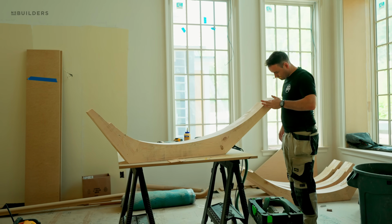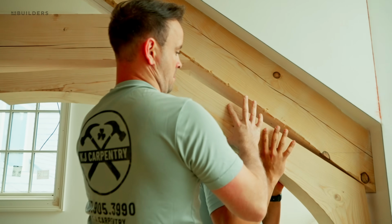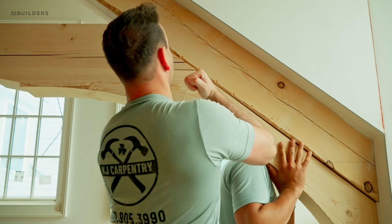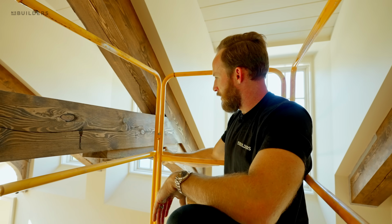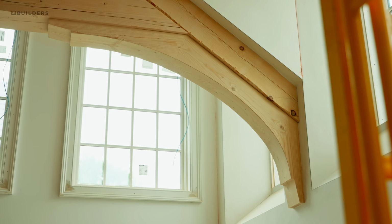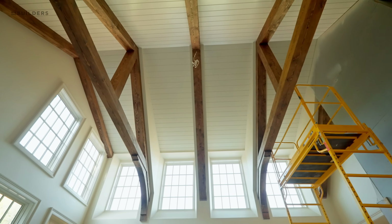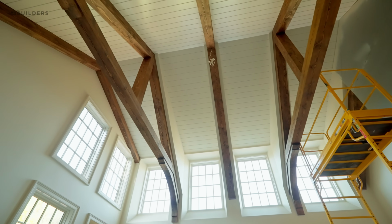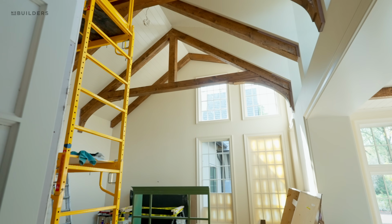And then everything is anchored through the face of it. Now, I mentioned earlier in this video that all of these beams are tight to the framing, and then we brought our plaster detail to it, or our tongue and groove detail behind it. In this case, for the bracket, we actually land on top of our plaster here. These are a decorative bracket. A couple things that these do: they cover all the screw holes that are in this cross member that attach it to the rafter. And lastly, they bring these down and soften the look of these trusses, beams, rafters, whatever you might want to call them, but essentially bring this cross member, curve it, and bring it down to the face of our plaster. And we have construction adhesive on wood-to-wood surfaces, but we do have some screw holes that did have to get filled, but ultimately very minimal.